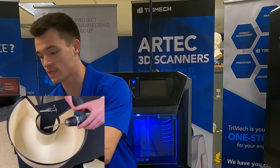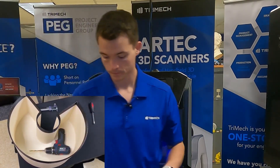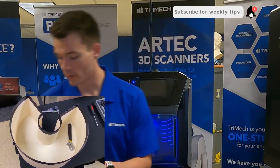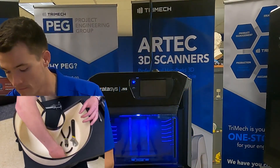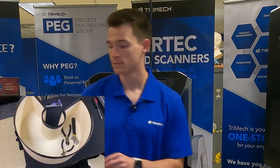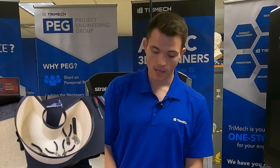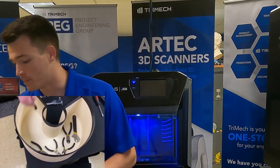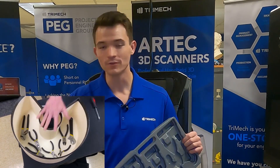Now what about this drill? You can see here this fits in this build tray without problem. But we could take all of the different pieces and arrange them on our build tray in an advantageous way that allows us to stack many different parts on this build all at once. One of the best advantages of the circular build tray design is that so long as we're printing in all three lanes of the printer, the build time is not going to increase. That whole tray of tools fits in the build volume.